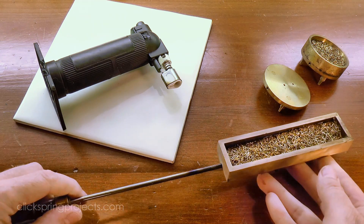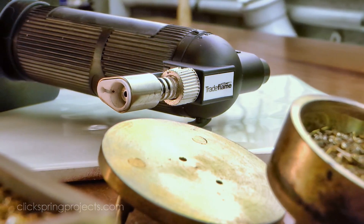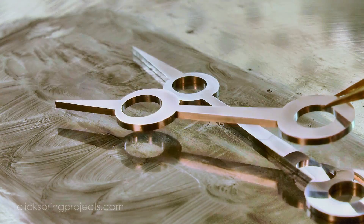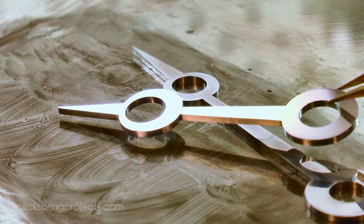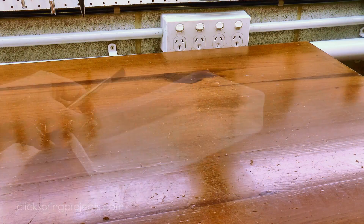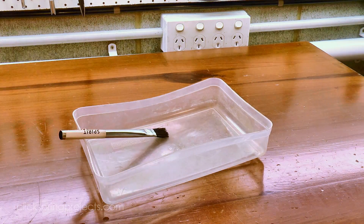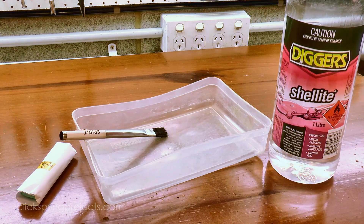I've made a dedicated set of bluing tools to help me do just that. The second thing we can say is that the surface finish of the metal will have a big effect on the light reflected from the metal surface — broadly speaking, the better the polish, the better the final blue colour. And thirdly, cleanliness is crucial. Any sort of contamination will not only affect the way the oxide forms, but also the light reflection, so we want the work to be meticulously clean just before we start to heat it.